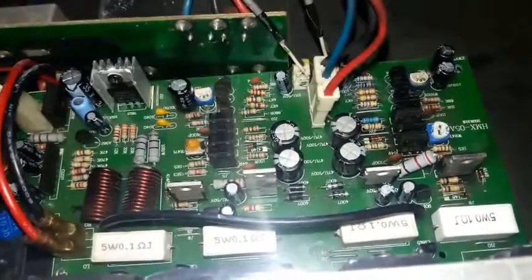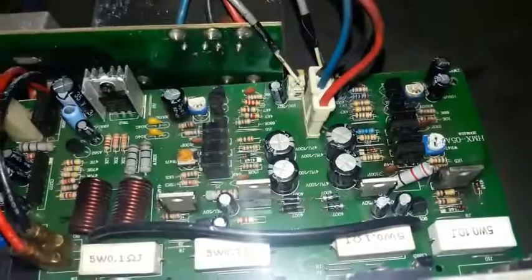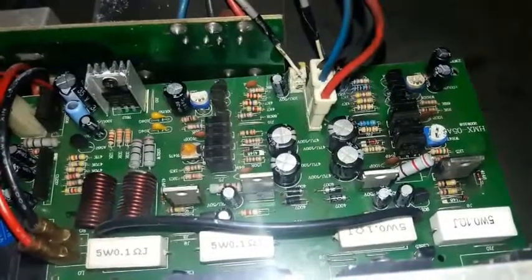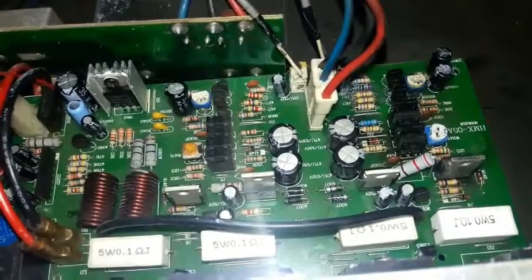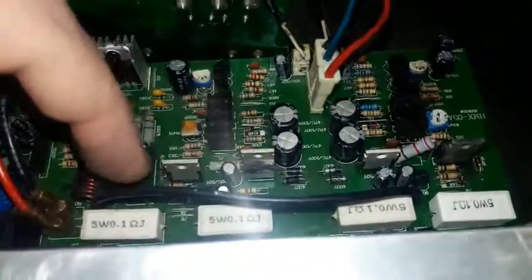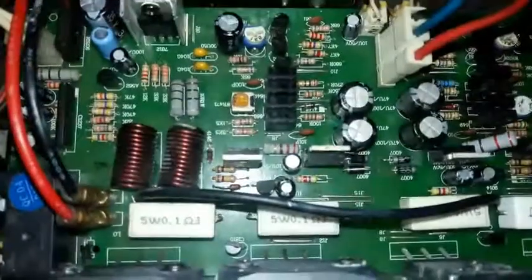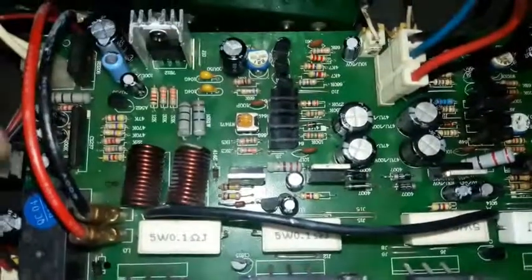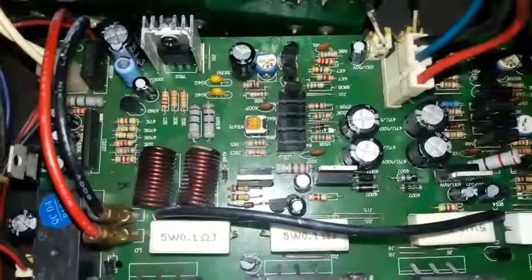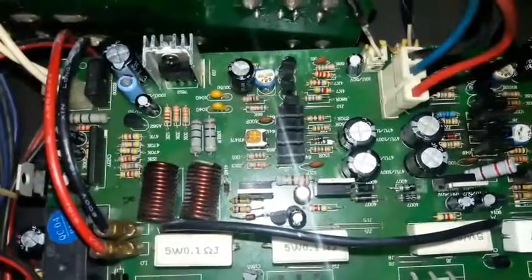I don't approve in this method, so I'm going to use a 3mm thickness washer in order to make it tightly installed. In their method, they are applying too much pressure to the transistor pins, and that is wrong. This PCB must have 4 screws for each side of the PC board, and secure it tightly so it doesn't wiggle into the breeze like they say.